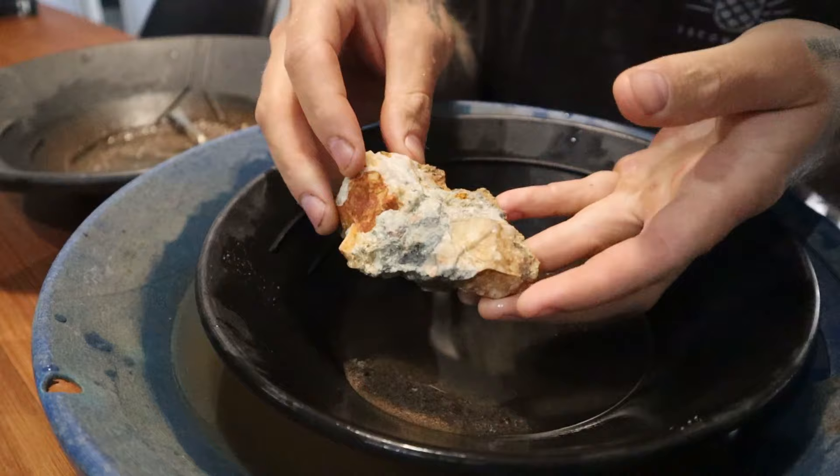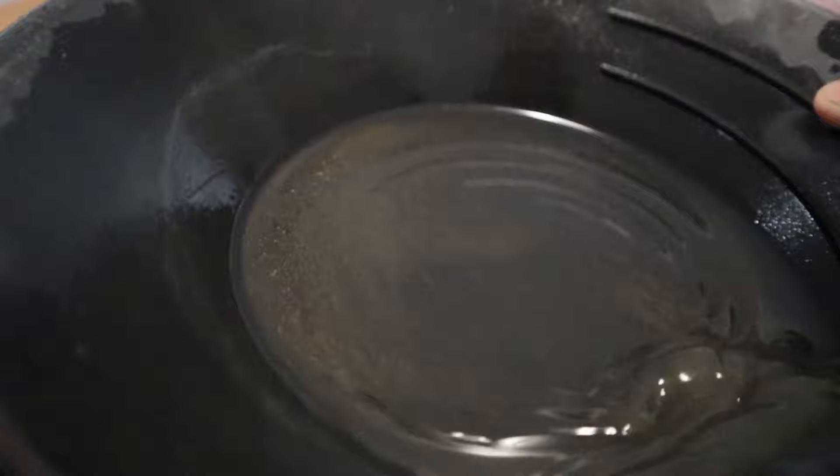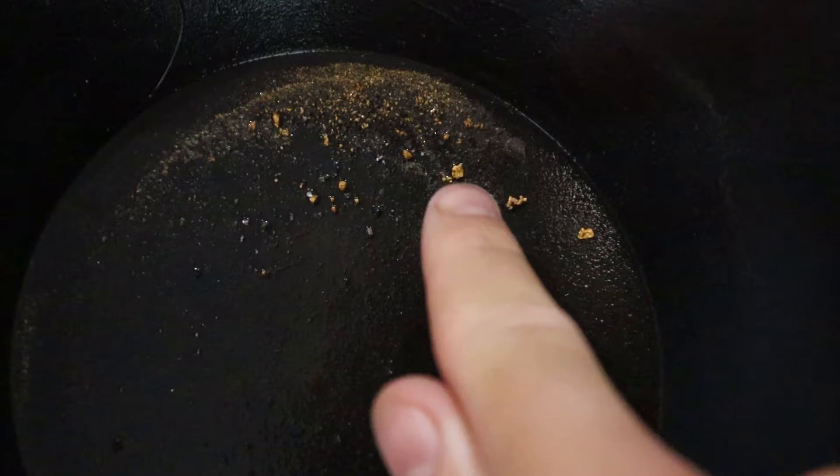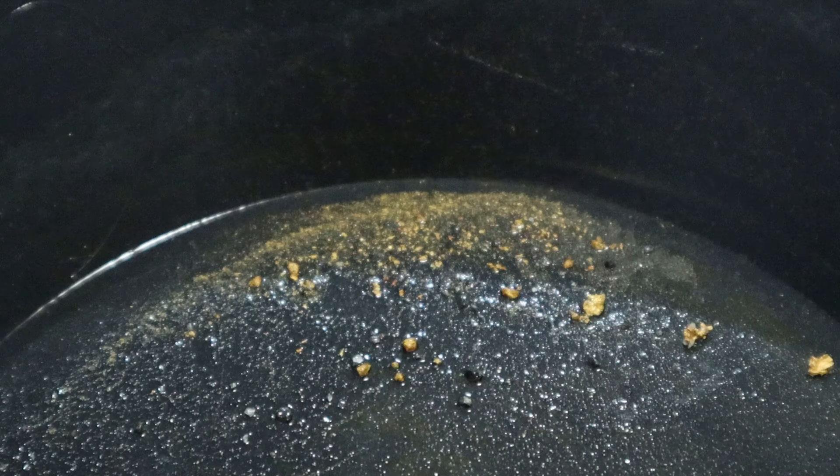I've kept a piece of the ore we crushed to give away completely for free — drop a comment below for a chance to win it. This is the last couple of teaspoons and we've got a good amount of fine flour gold. This has honestly been one of the hardest ore processes I've ever done, simply because of the sheer quantity of sulfides. We started with one 40-litre bucket of ore, ended with about 30 litres of crush after burning and processing, and this is how much gold we got. All in all for one and a half buckets of processing, that is a decent gold take — we'll go back over this chemically at a future date.